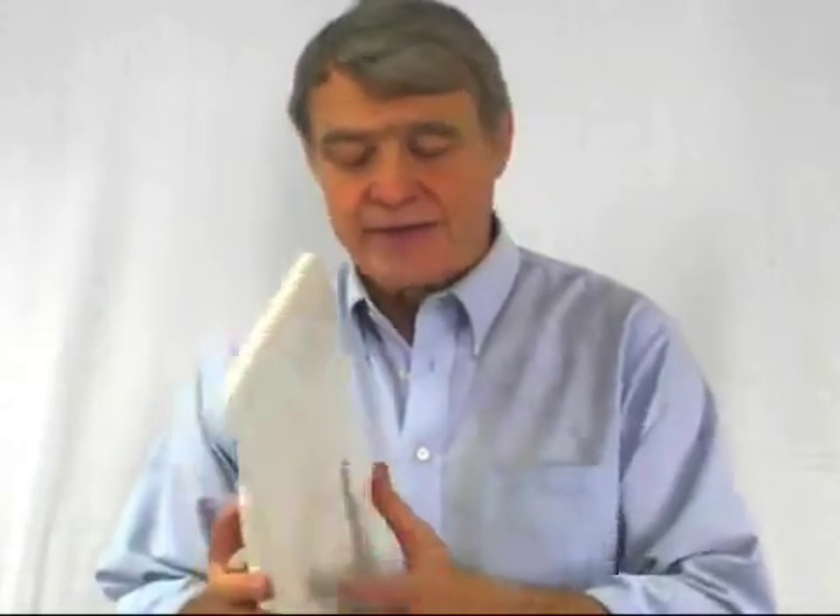The new subscriber units are what we call a small form factor subscriber — it's this size of subscriber. They're available integrated with an integrated antenna in different types and different sizes of gain: 23 dBi, 17 dBi, and 15 dBi for the 5 GHz band. It's also available just with the unit itself, connectorized for external antennas if you want to put a dish or a specialty antenna on the subscriber. There's also a version with a small embedded antenna of about 15 dBi gain that is also connectorized for an external antenna.